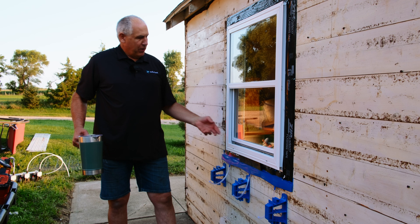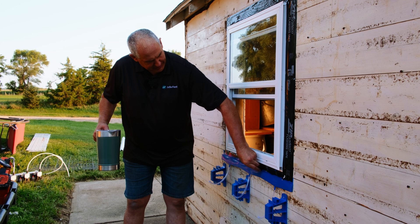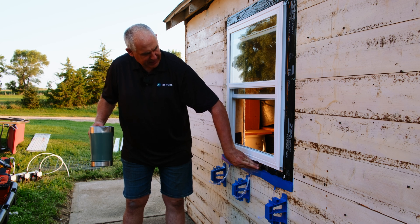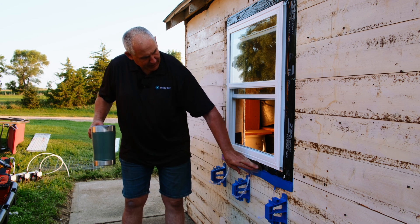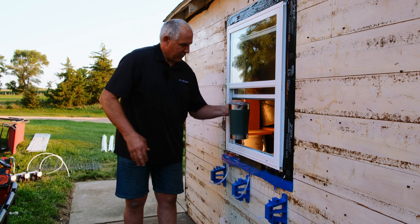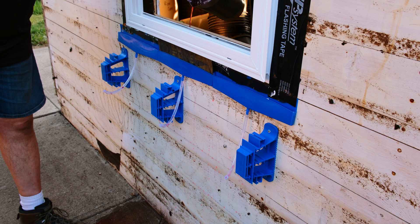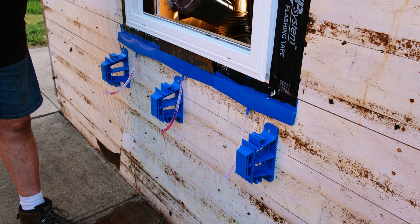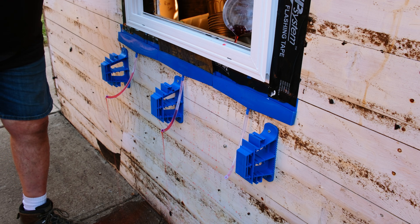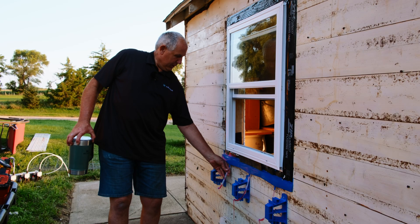We're going to demonstrate how the window gutters drain. We're going to put some water in the back flashing here — this has the dimpled drainage mat that goes right into there. These have not had it put in yet just so you can see how it works. I'm going to pour some water in there, and you'll see it almost instantly starts draining out. It has an easy, free-flowing drain so you're not going to have any water building up behind there — you're going to have perfect drainage.